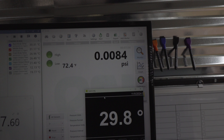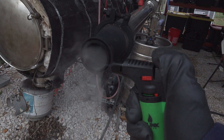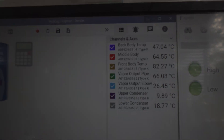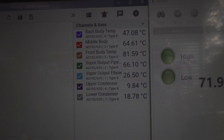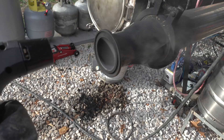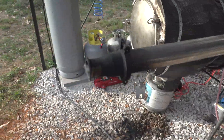We started the machine here. Six minutes in, this vapor is non-flammable as usual. Someone in the comments suggested it's probably mostly just water vapor and some carbon dioxide, maybe some carbon monoxide — things reacting with a little residual oxygen left. Twenty-two minutes in and the vapor is still non-flammable. In my last run where we shredded the plastic, the vapor was flammable by about 20 to 25 minutes in, but it's not flammable now.